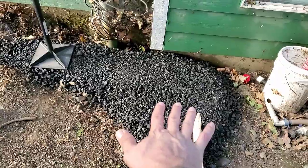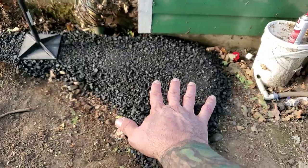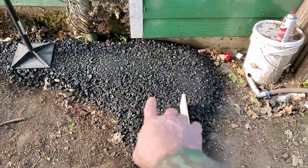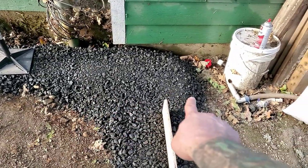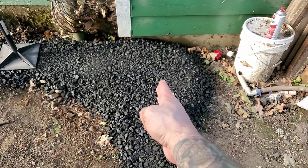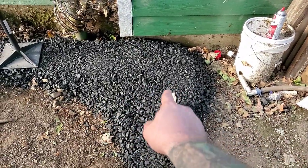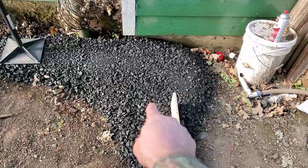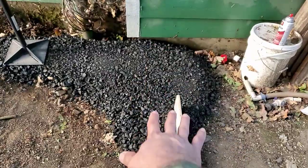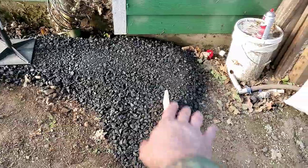So this was my lowest point in this whole job. So I needed more gravel, a wider base, because earth is not holding it over there. So a much wider base so that the foundation that's going to go here has support outward on all sides. And because it's such a deep pack, I put gravel and packed, wetted it down, packed until I got to this level.